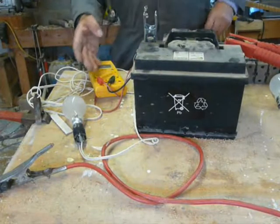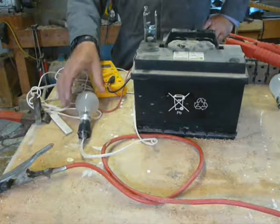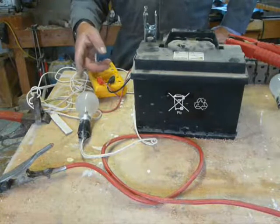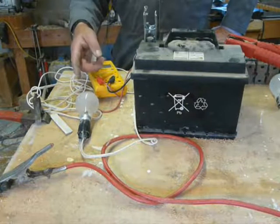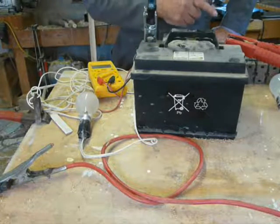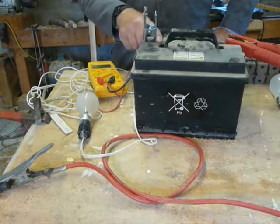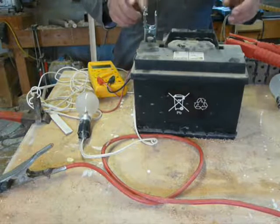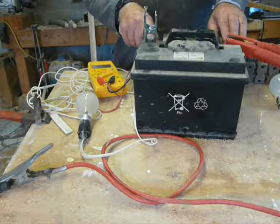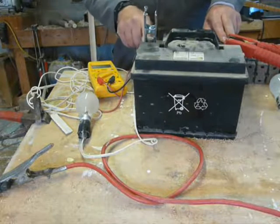What we have effectively is a DC supply regulated through a resistance, and you can change the charge rate by swapping bulbs. The thing is, you can see it's working — even with the 150 watt bulb you can see it glimmering. It's constantly feeding into the battery, and in the battery shed the output of this battery acts as a buffer, which then feeds the charge controller.